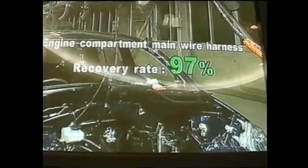In the previous model, the wire harness was installed within the instrument panel. Now the wire harness is on the panel reinforcement, an easily accessible location. Also, the junction block attachment has been notched so that the notch will tear when the harness is strongly pulled up. The dismantling belt has also been added for the floor and the doors.